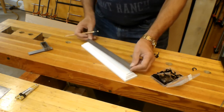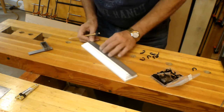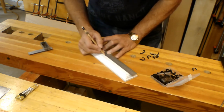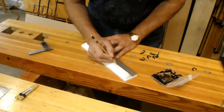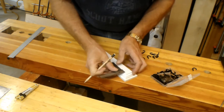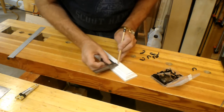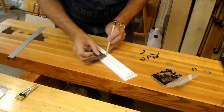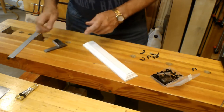Now I'll tell you, if you don't have one of these — a steel rule — you really need to get one, because a tape measure for this kind of project at this point won't cut it. So all I'm doing is dropping these in at the inch-and-a-half mark. Now I'm going to get a cross mark — I'm just going to come in here and hold this. These are small enough that they're going to get covered up by the key hook. So this should give me all the marks at the right places. Next I'm going to drop a hole.